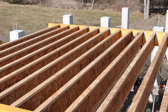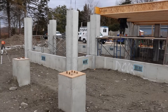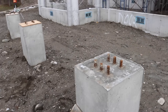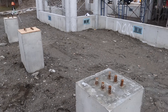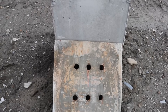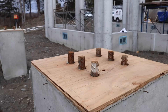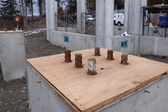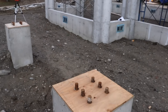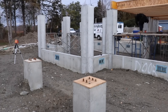Now let me hop down and show you how we're connecting the steel beams to the concrete piers. The steel beam and steel column connections to concrete piers, whether the tall piers or these shorter ones, are the same. You can see these plywood templates we used — we did that so we could set these six rebar anchors, these dowels, into the concrete pier without conflicting with the rebar reinforcement for the concrete pier itself. The plywood will come off, and in its place we'll put a half-inch steel plate pre-drilled so the rebar dowels can slide right through. The hole in the plate will be bigger than the rebar, so we'll plug weld the plate to the dowel, grind that flat, and it'll leave a nice smooth flat surface for the steel beams and columns to be welded to. So now you have a full connection from your steel beam or column to the concrete pier.